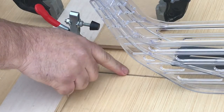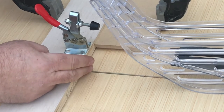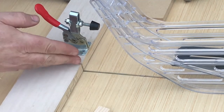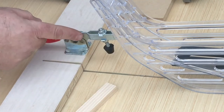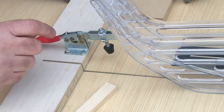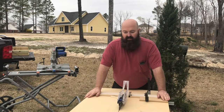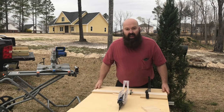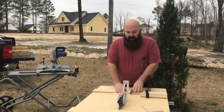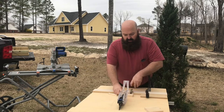Since the kerf of the blade is already cut, you can measure at any point you need to. If you need to change measurements, you just measure to that kerf and you know it will be an exact cut. The clamp is adjustable for different thicknesses of material, so it's completely accurate. It's as safe as can be for a sled — it slides very nicely and I keep my hands away from the blade while cutting, only reaching in to change or secure the material.